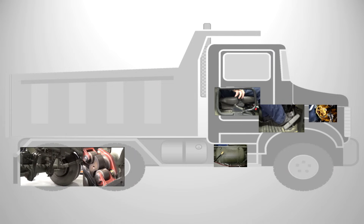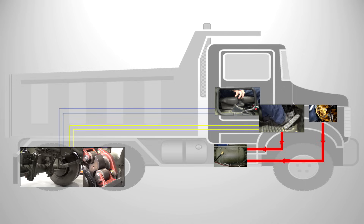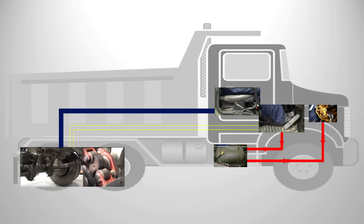As we had before, the air compressor supplies the reservoir which holds compressed air ready for use, and the reservoir supplies the driver's controls. But it takes far longer for the air to reach the secondary chamber on the spring brake actuator and in turn compress the power spring and release the brakes. But that's not so bad — it just takes a bit longer for the park brake to be released.